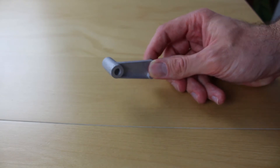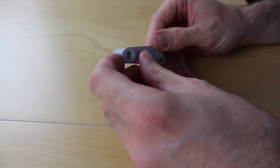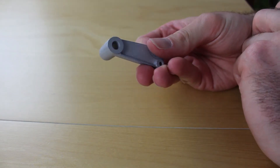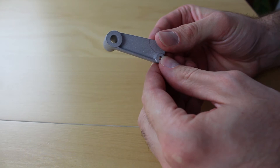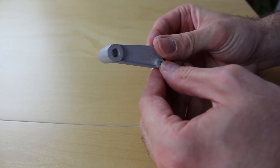Another downside is that the surface quality of the metal prints is very rough when they come out of the printer. I have an aluminum 3D print here and I'll zoom in a bit so you can see the roughness of the part. In CNC milling you don't have this issue. You could do some post-production and put it into a CNC mill to clean it up, but straight out of the printer it looks very rough.